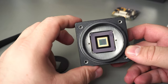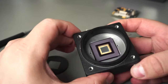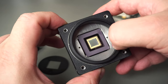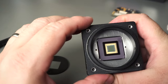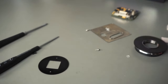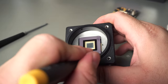I took out the front metal cover with a couple slot screws. There's some grease under there, which is kind of annoying. Looking at the corners, I can see that the sensor is actually sitting on some metal, so this has to be socketed. I'm sure it's going to be ugly when I take this out, but luckily we're not using it for anything. Let me see if I can wiggle out this board — I am sure this is not the correct way to do this; they probably use an IC puller.